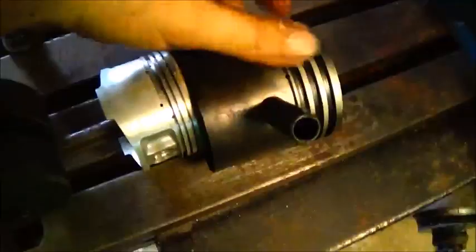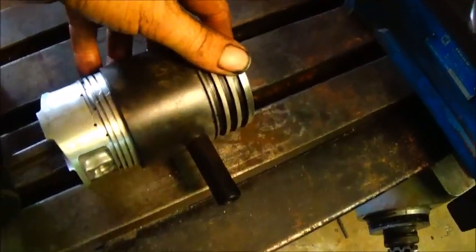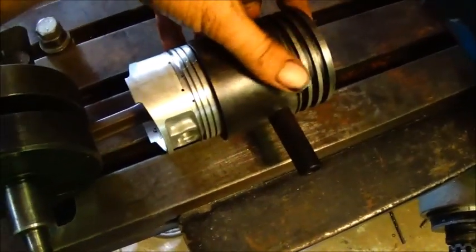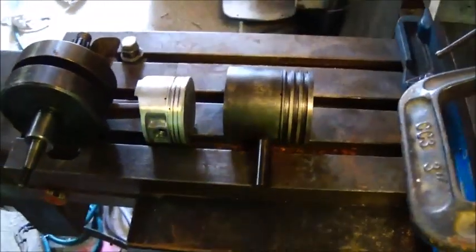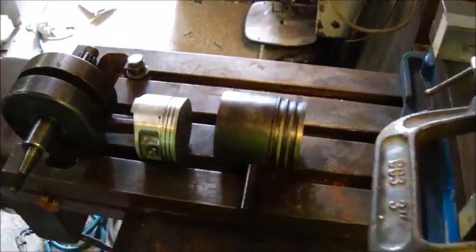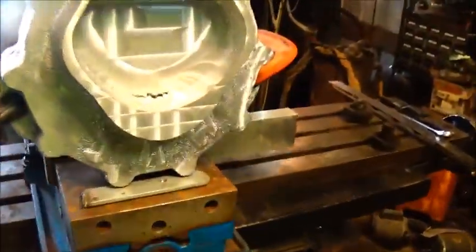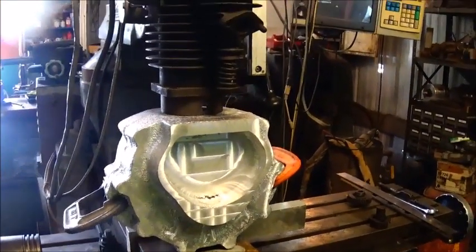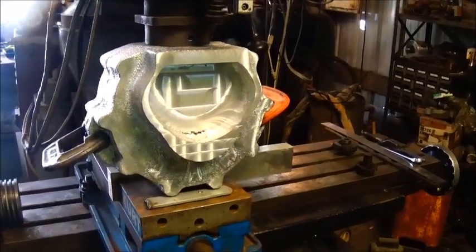To give you a size comparison, the piston compared to the one we used on the last engine — as you can see it's a little bit bigger. The crazy thing is, because this is a four millimeter shorter stroke, we're going to have a smaller cubic centimeter and smaller cubic inch — just a little bit smaller engine. Instead of 280 maybe it's 250 or 260, something like that. I'd have to do the calculations again but no big deal, we're not worried about that.